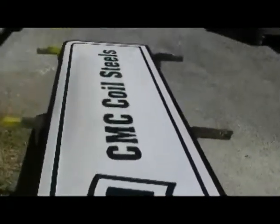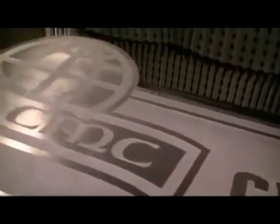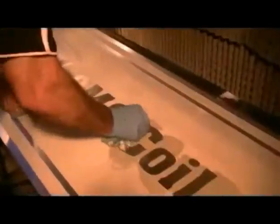Here we have a 2 metre, or 6 foot long, 3 millimetre thick aluminium sheet that we have also laser profile cut. From this point the sheet is pickled in our metal cleaning bath and then coated with a photosensitive resist. The artwork is then exposed under our halogen UV lamps for a controlled period.